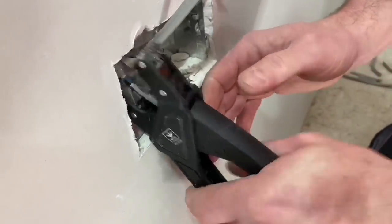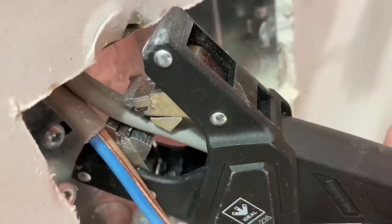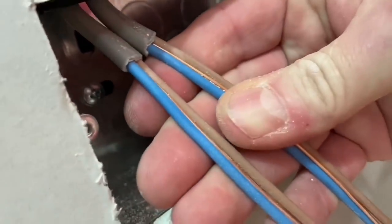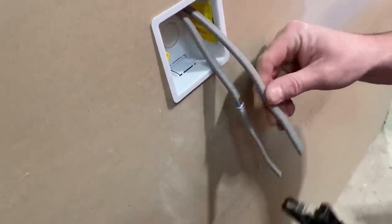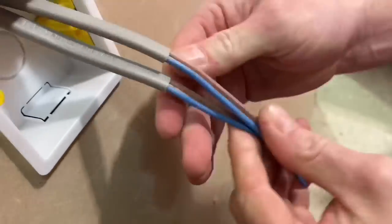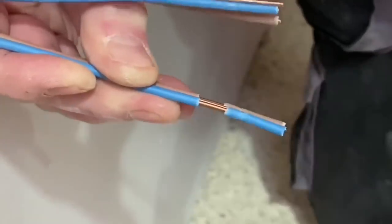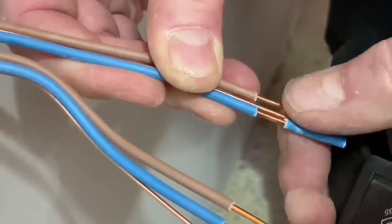Into the box — general squeeze — see how much cable's come through; plenty for the second fix. You can't go right up to the grommet, so there will be some outer sheath inside the box, which is acceptable for the accessory. Squeeze down and look how easy it is to pull them off. In a dry-line box you have more ability to move the cables around. Strip these back quite a long way from where the cable comes into the box at the desired length — once stripped we can move the cables back into the wall. Strip them off — super easy. Then removing the insulation on two conductors at the same time. Pull them off — can't get much easier than that. Bite down, pull back, slide them off.